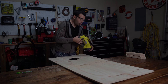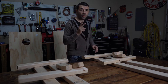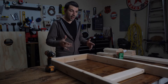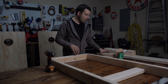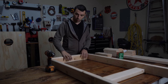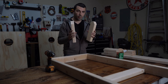Let's backtrack a little bit — I did forget to mention that you need to do two more 21-inch boards and two more 11-and-a-half-inch leg pieces, and make sure to round those. Now grab one set of everything: your two long pieces, your two 21-inch pieces, and your two 11-and-a-half-inch pieces. We're going to create the outline frame for the plywood. The 21-inch boards go inside on both ends — screw them in on those sides.